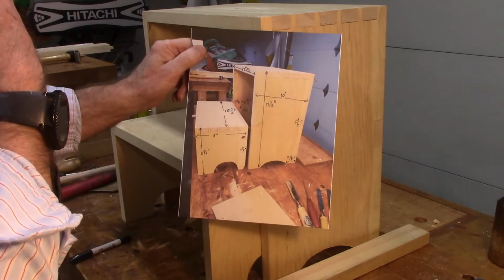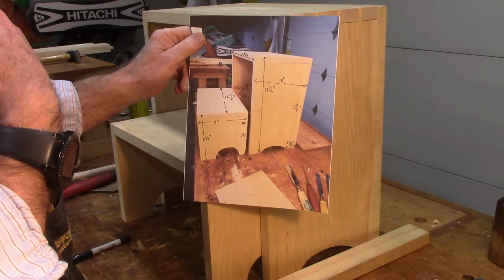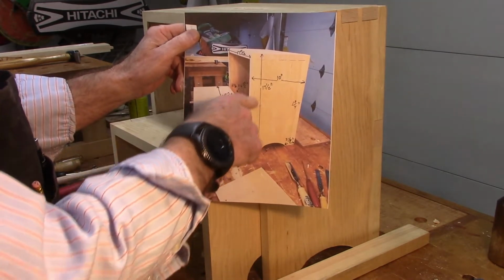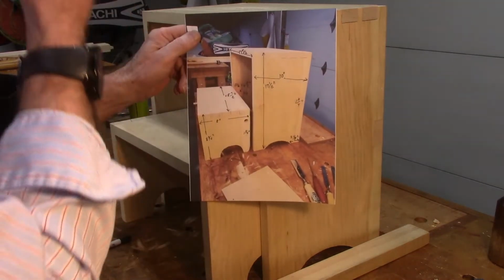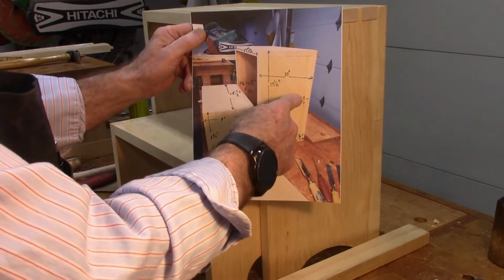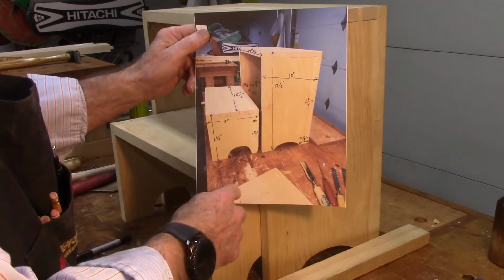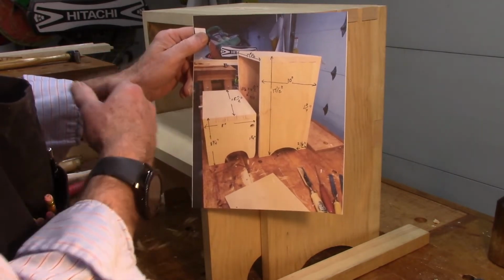Well, this is the dimensions of the piece that we're going to make, and hopefully you can pause the video and copy the dimensions down, although you can make it any particular size that you want. But I picked 17.5 inches high because that's a good chair height, because I plan on sitting on the top. It's 10 inches wide, that little reinforcing cross piece in the back, 1 3/4 inches. I got 2.5 inches for feet down there, and it's 17.5 inches long.